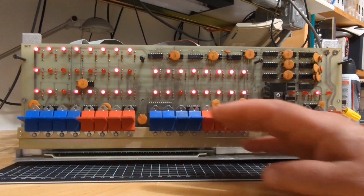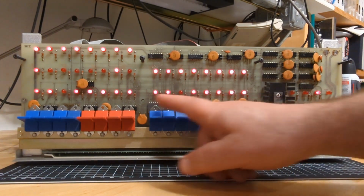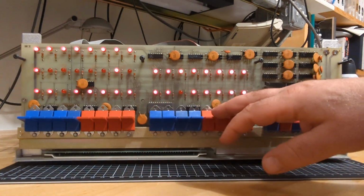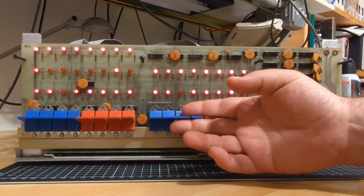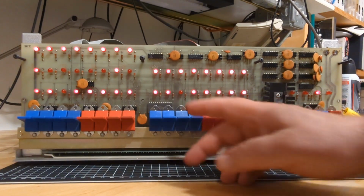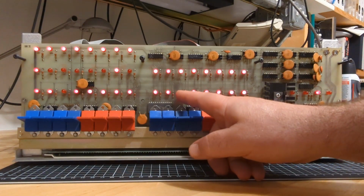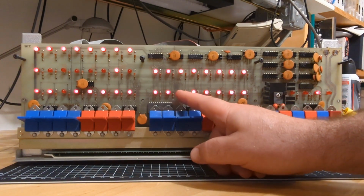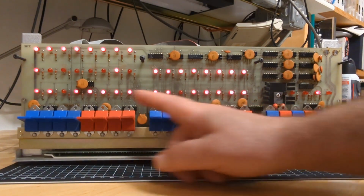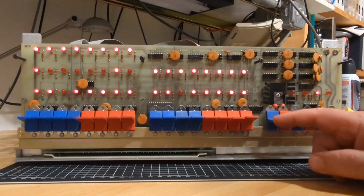But we can look around and see why this is so. In the schematic, we can see that there is a relationship in here. We already sort of know it. Remember all these 8 switches and all these 8 switches. These are just connected up to the data bus through their various open collector drivers anyway. So it shouldn't be a shock yet to notice that D5 is the same physical wire that also expresses the values of these bits here, indirectly, as we'll see.